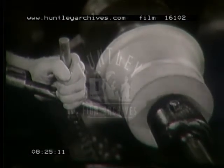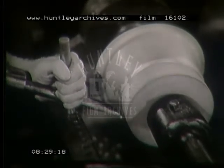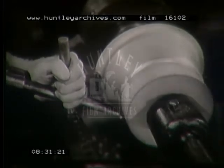If buckles appear in this flange, get after them right away. If they are not too bad, holding a smooth wedge-shaped hickory stick called the back stick solidly behind the buckles, you can often work them out with the tool. If this doesn't work, the spinning should be taken from the chuck and the flange hammered smooth. After the breakdown operations are all completed, starting at the tailstock and working outward, a final spin is made to lay the shell tightly against the chuck.